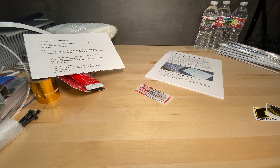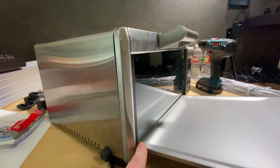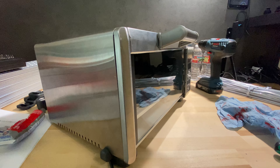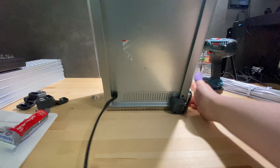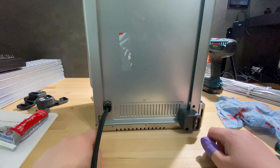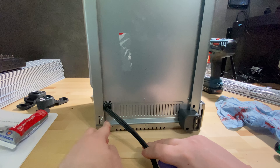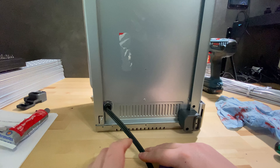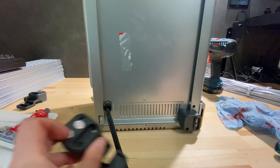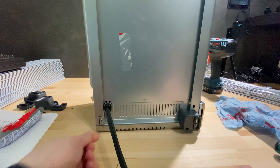Let's start working on the toaster oven. The first step is to disassemble it. I removed the drip tray and the food tray from inside, and then I started working on removing the feet. I managed to only remove two of them. Those feet were held in place by two screws, and there was another hole for a rivet that I had to drill out.